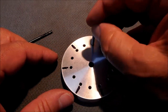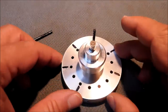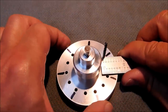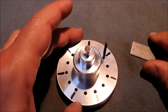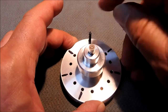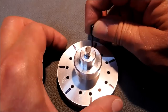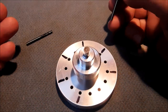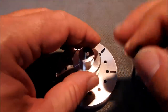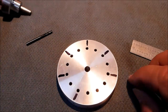We could do this one of two ways now, starting to drill the hub. We could use the hole as a rotational bump stop, which would be the fastest way to do it, or you could drill two holes in a backing plate, one at a quarter inch, one at an eighth inch, and use this just like a rotary indexer that you would buy in the store. I would say if it's a critical setup, the two holes would be the better. But now a lot of you guys are going to say, oh man, I don't know